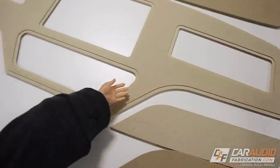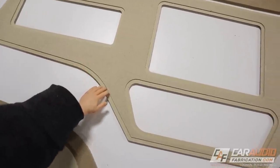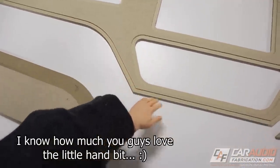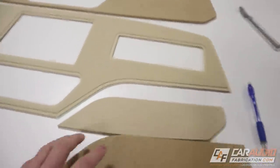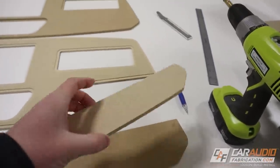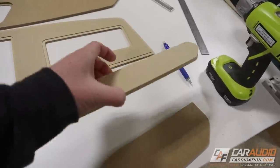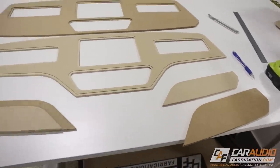Now that I have all these small little grooves cut on the back side of the panel here, these will give me some relief to wrap the vinyl around to the back side of the panel and then trim the edge. If you remember on my rendering on this corner piece I have all these grooves. I want to make those grooves next on these pieces, but these just serve as my master templates. What I'm going to do is make those grooves on a separate piece first and then precisely line them up the way I want them to be, and then flush trim a copy cutting out that shape that already has the grooves.